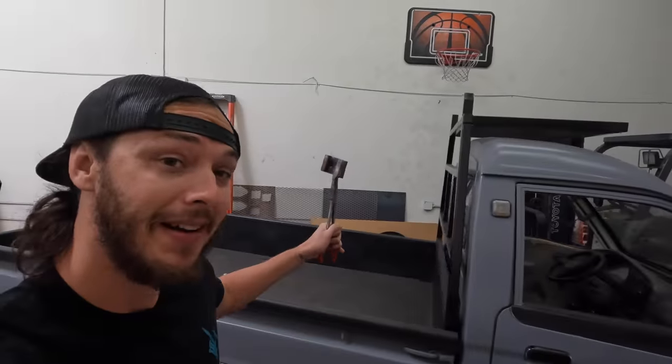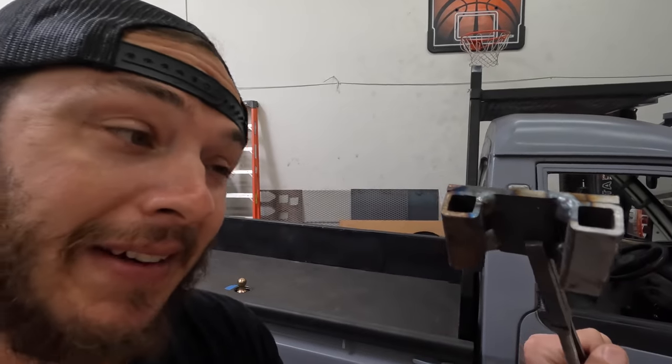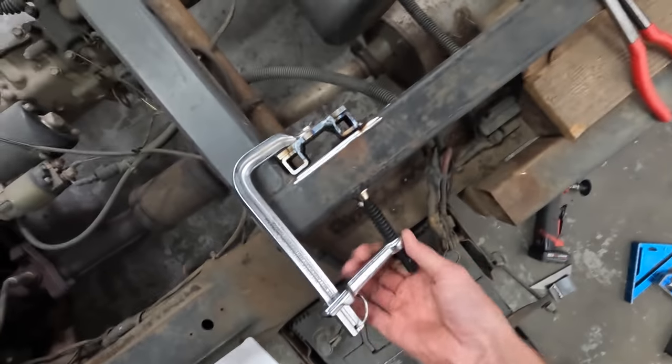Oh yeah. Okay, so without having that 3/16 on one side, since we're gonna put all of our spacing on the other side, that space ended up being pretty dang big. So this is the spacer I made for that side. It's still super hot because I just welded it. This is what we're gonna be using on the opposing side. It's strong enough to use as a spacer. And then I ended up spacing these two pieces of, I don't know what that is, 3/4 by 3/4, far enough apart that we could actually run a pin through the middle and we're not trying to drill through all of this. Okay, so we've got this spacer tacked in place here and let's go for the close.